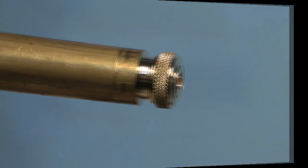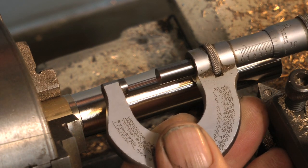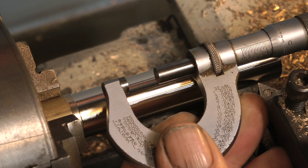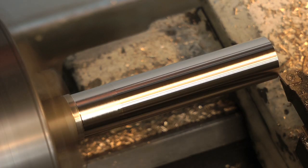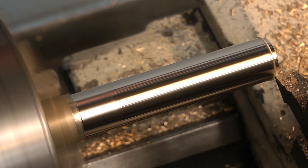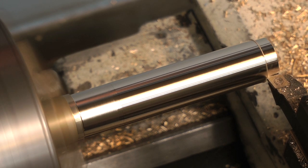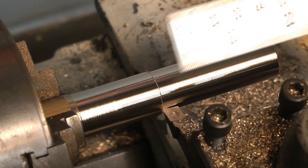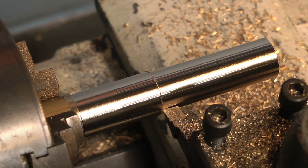When you've finished it should look something like this. Normally we would part it off using a parting tool — more about that later. The exercise you've just followed is a total freehand exercise. In reality you'll be working to a drawing usually, so you need to turn things to exact dimensions. For this you will need a micrometer. Using brass for these exercises is a little extravagant because it's quite expensive — you could use mild steel, but mild steel needs slightly different treatment and gets a lot hotter during cutting.